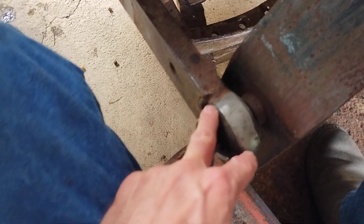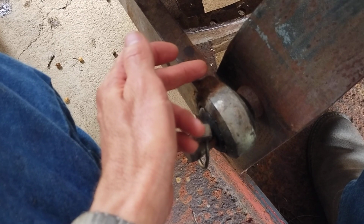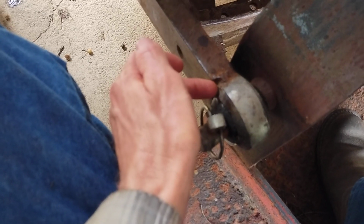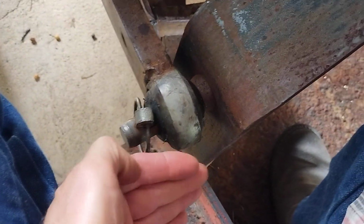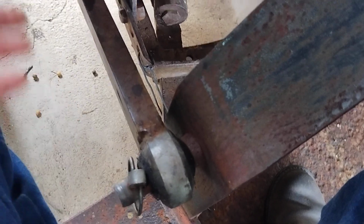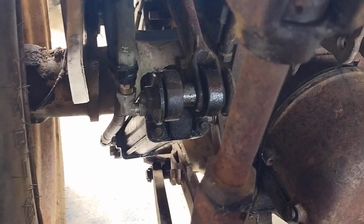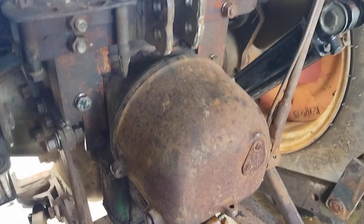because multiple of my attachments don't work there. Because in the past, when I had to replace the knuckles here, I maybe should have got some that had a plate attached to them and then just cut this off straight and welded them straight on. But this rounded weld provides more strength. It's inset into that piece of material, and I didn't want it sticking out quite a bit further here, because then there's less lifting strength on a somewhat light duty system here, although it's a lot heavier duty, at least for the cylinders I put on it, than a lot of your normal little utility tractors.